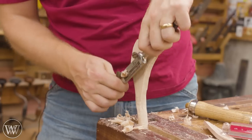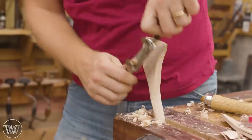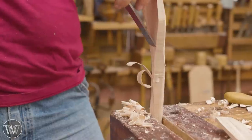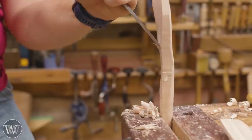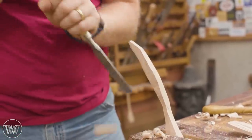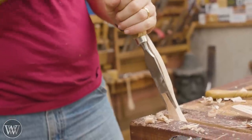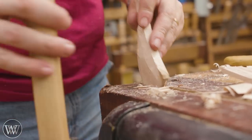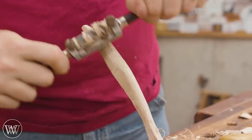On the large flat surfaces it's a little bit more difficult because you're cutting a larger area, so there's a bit of a rounded surface to it. On the back, I was originally trying to make it big and tall like some of the Scandinavian spoons, but I decided I really want to thin this out and make it something thinner. So I'm carefully chopping down in, trying not to break the spoon, thinning it out and taking out a lot of material with the chisel. Then I can come back in with the spokeshave and remove a little bit more, chopping in from one end and then turning it around to chop from the other side. I want to start thinning out that head even more — tapering it down, putting a bit of curvature on the back.